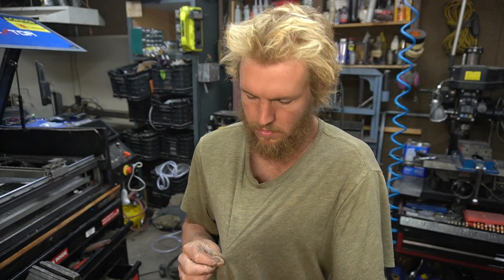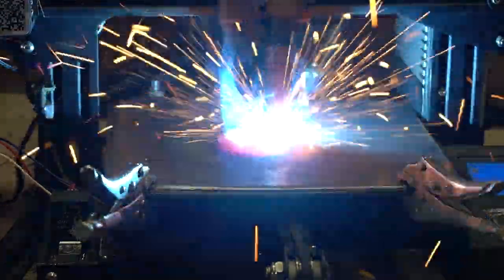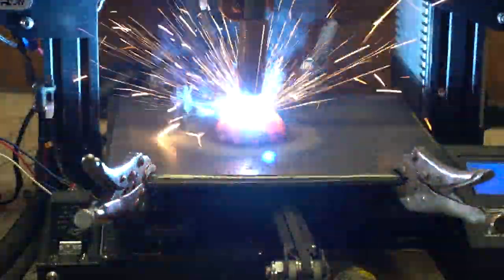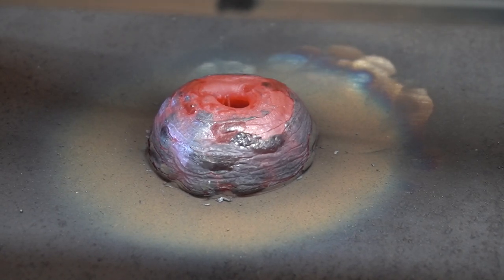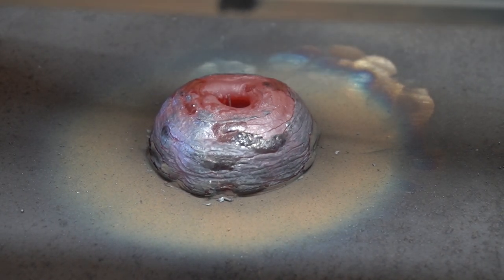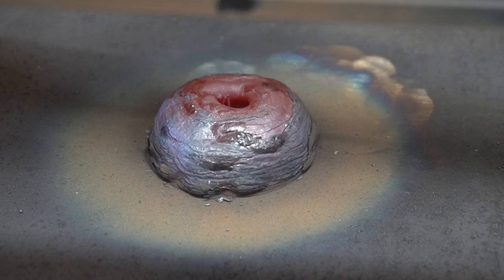Future me here — oh how embarrassing, I'm wearing the same shirt. I'm not gonna make you watch a million more failed prints. I tried adjusting the settings over and over and never got happy with the results. That problem could be remedied by having a variable feed rate with a stepper properly programmed to feed the wire, but in this video we're doing the quick and dirty method. So my solution — no cool-down time. That's supposed to be half of a sphere and honestly it doesn't look too bad. I clearly had issues closing up the top but I kind of had a feeling that would happen. This is crazy — it's kind of working.